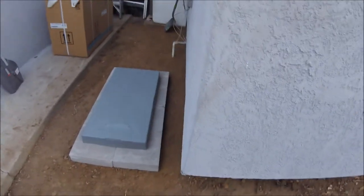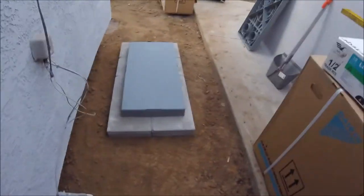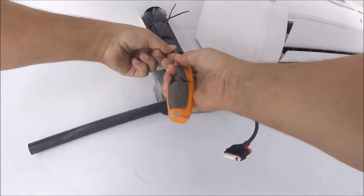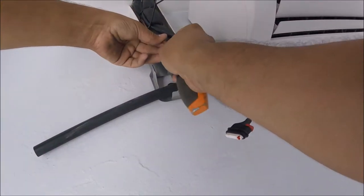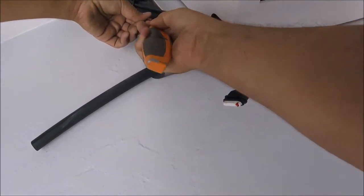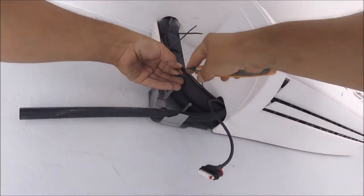I was going to pour gravel and then put the pad, but in my mind it looked better to do this instead. Right here I'm using a kit that comes with a condensate pump. You can see I already ran the copper there for the drain. The pump mounts right there where you see that black housing, and that multi-pin connector hanging down goes into the pump — it powers it and also serves as some kind of safety overflow switch.